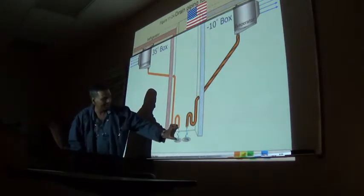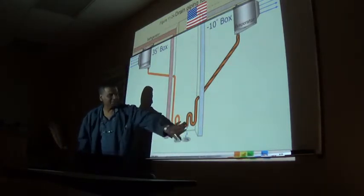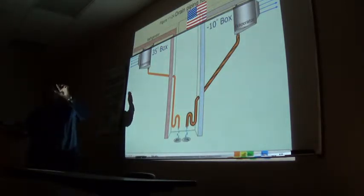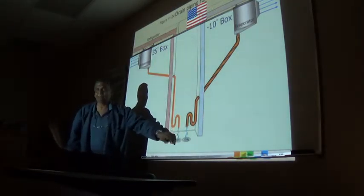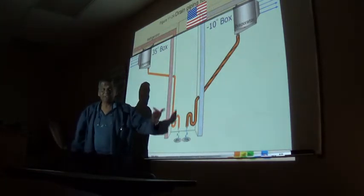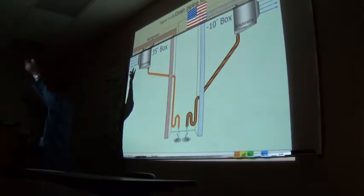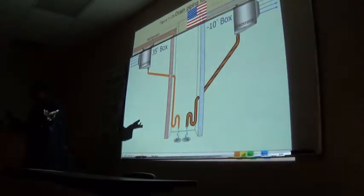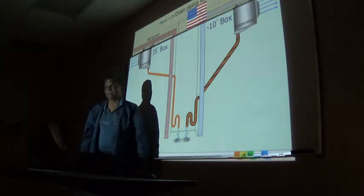And you see this air gap? The health department required it at one time. The first time it was 1 inch, between here and here, there must be a space of 1 inch. Now they say 6 inches. Then they went back to the 1 inch. So guys, I put it at the 1 inch. Let them tell me. I can always cut, right? It's easier to cut it off than to add a piece on.